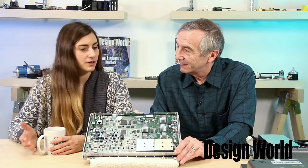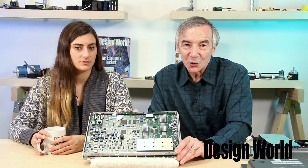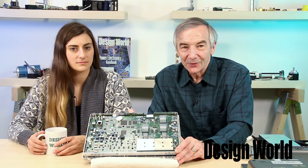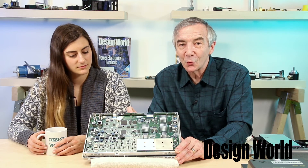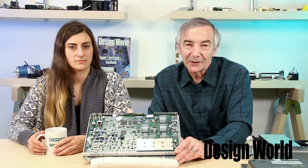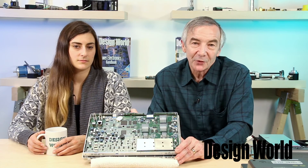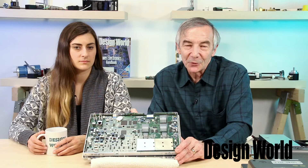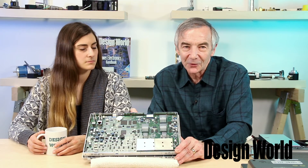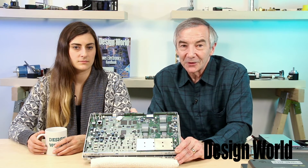Now, there are still some big chips on the board that we haven't talked about yet. That's correct. The display driver chip also has connections to the biggest remaining chip we haven't discussed yet, which is an Analog Devices Blackfin processor that runs the scope. It sits over here next to a Micron 128 megabit synchronous dynamic RAM chip and a 128 megabit flash memory chip from Spansion. When you tell the scope to memorize the settings for a particular test setup, the information gets stored in that flash memory. The Blackfin has a RISC instruction set that's known for fast execution times, and it runs up to about 600 megahertz and only dissipates about 2 watts at most, so it's often used as an embedded processor in appliances and instruments like this one.